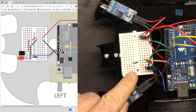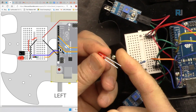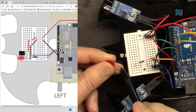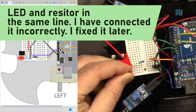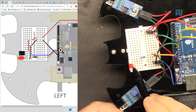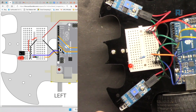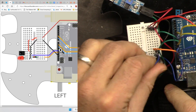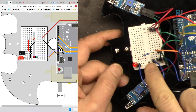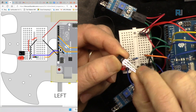Connect it somewhere on the breadboard — that's our pin 13. Then get a 330 ohm resistor for the LED and connect it somewhere. Get your LED with the longer pin connected to where the resistor is connected and the other pin on the other side. Connect the negative side to the ground so our LED is ready.